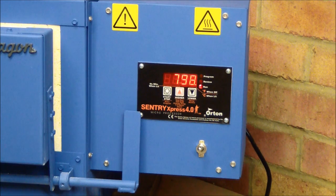But I like to take them a little hotter — I tend to take them to about 820 to 850 degrees centigrade. Because the kiln has gone on a very fast ramp, it may overshoot by a few degrees, but that's not a problem. I'll allow the kiln to sit at that temperature with the blades soaking in the heat, just to make sure they're thoroughly heated through, and then in 5 or 10 minutes I'll remove them one at a time and give them their quenching, which will harden them.